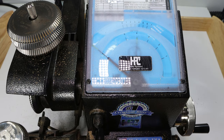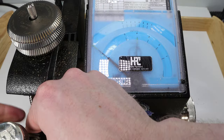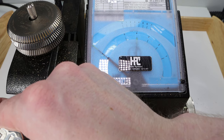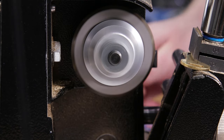So now let's work on our second key, which is going to be the one that had the blind code stamped right on the key. So the code we're going to cut to is going to be 1130. So let's align up our M1 blank right here. Turn our machine on. Cut to 1130.